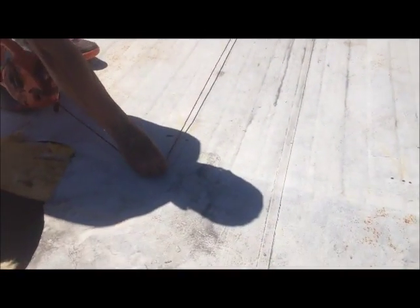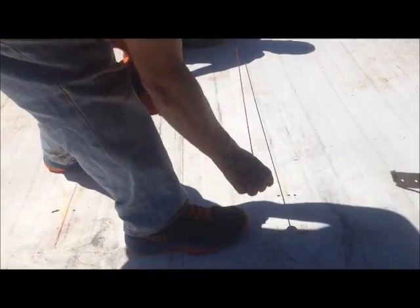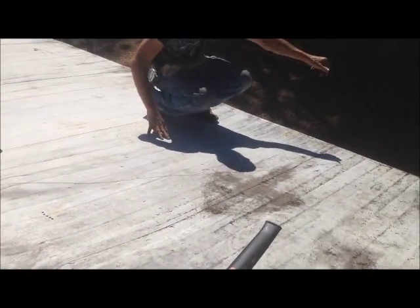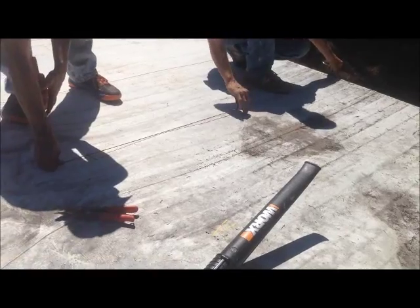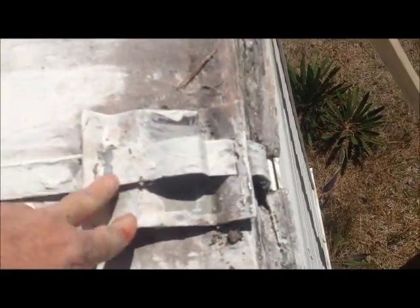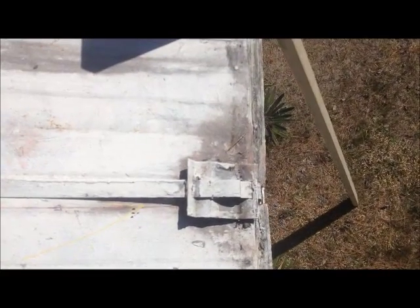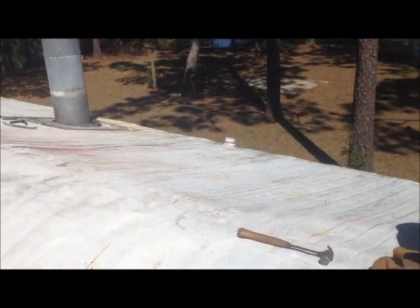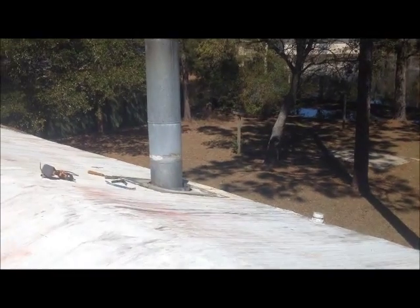Listen to all that crinkling tin. That is the way it's done. If you leave out this step, you might as well forget about it. The straps come across and they've put vinyl siding on this, so the straps come across here. What we're going to do is flatten these out, cut our plywood around it, and then put our insulation board out to the edge to cover it over and finish it out. The insulation board will cover that completely and the strap will still always be there. We'll place all the plumbing pipe boots and cut across here and put a little seam at the bottom.